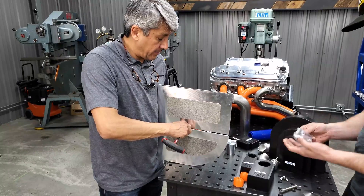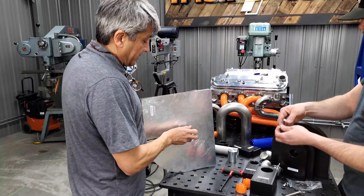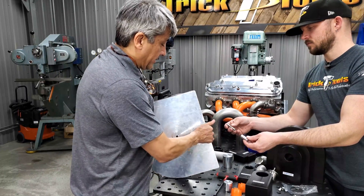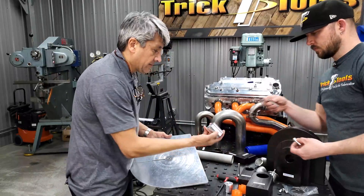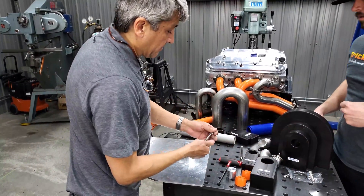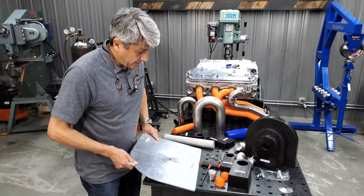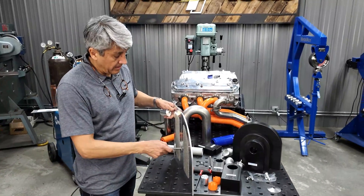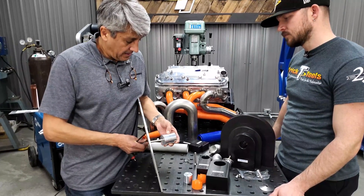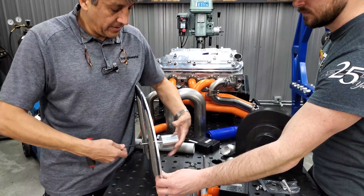This really allows the user to build not just exhaust headers or turbo manifolds, but also downpipes on turbo applications, cat H-pipes, or H-pipes using a single plate. We're going to use the FE series stud with the longer bolt. We recommend putting a little bit of lubricant on it because, as Bryson says, stainless steel and aluminum don't get along. Replacing the stud is very simple — just set up the new longer bolt and get it started. This conversion takes no time.